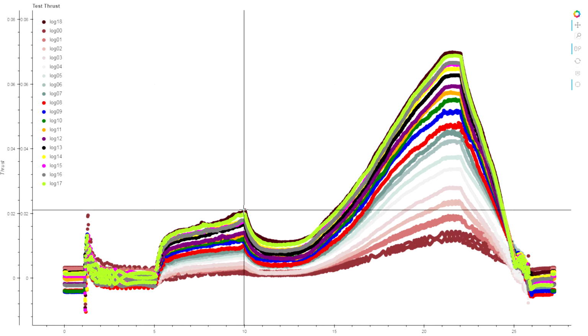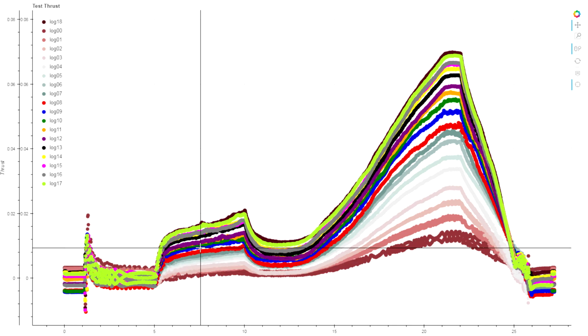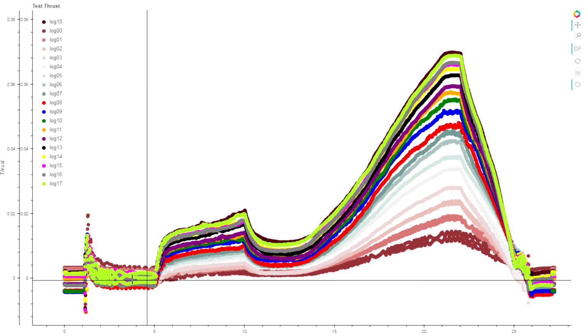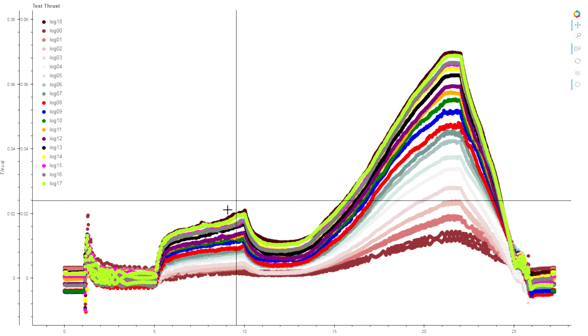And when I'm running thrust tests, which have just the motor directly on the load cell, we don't have these problems of loading and unloading and loading and unloading, because the motor spins up at idle and the prop is pulling it forward even at idle and has that sort of preload amount. And then we just run up to full throttle and stop from there. There isn't time for the load cell to bounce back and forth and give this kind of drift.